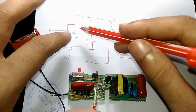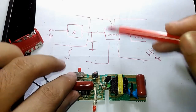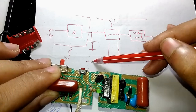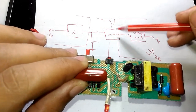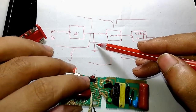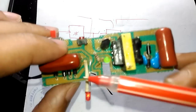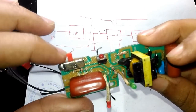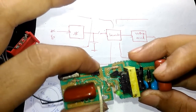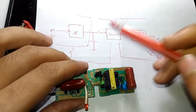We've now completed the rectifier, diodes, and battery section. The next thing that can fail is the inverter circuit. The battery is connected through a switch to the inverter. In most cases you will have two switches — the master on/off switch and a momentary switch just to deliver that zap. These two switches are in series of course.